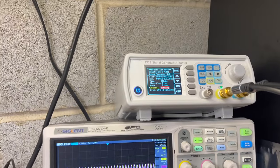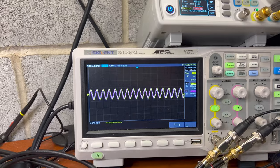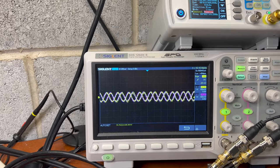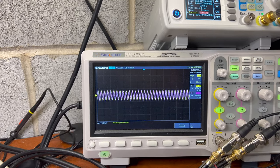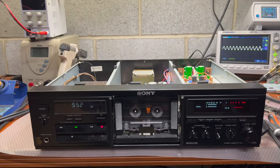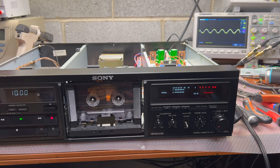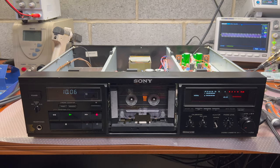You see, I put frequency sweep between 1 kilohertz and 15 kilohertz. And it's recording. So it's source and it's tape. And phase, recording phase is really good, pretty close. Good. Done with tuning. You see, it keeps level pretty well. And minus 20. Good. So that would be it. Nice deck. Thank you. See you soon.